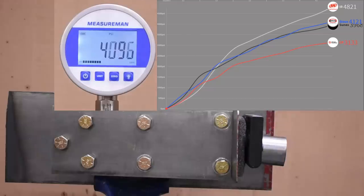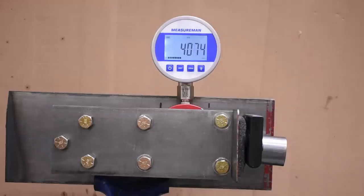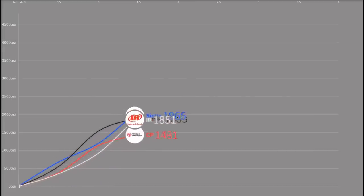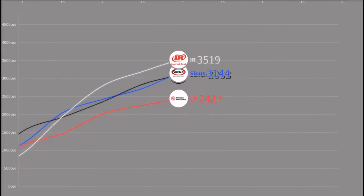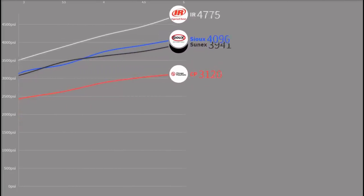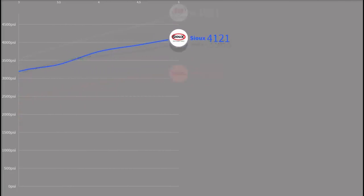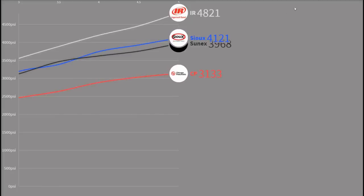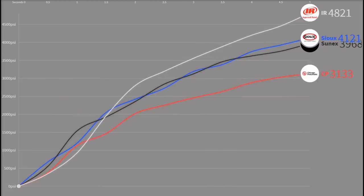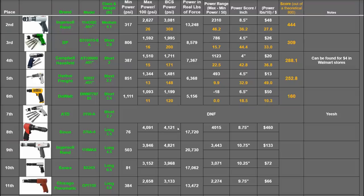The Suutools scores 4,121 — very consistent on the day regardless of inlet pressure, which is both a good and bad thing. Good in the sense that if your compressor can only support 115 to 120 PSI required to keep 90 PSI running in the tool, you're getting full beans. Bad in the sense that turning up compressor pressure won't do a whole lot more for this tool — or for its points today.